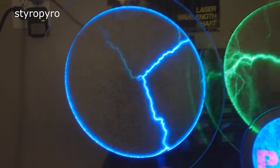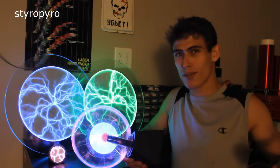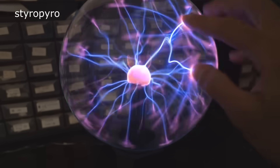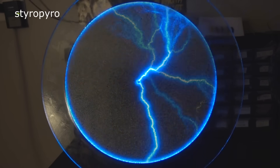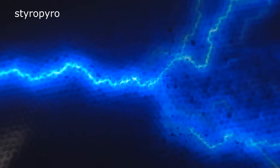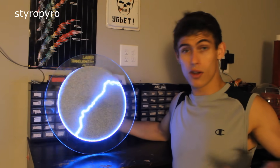I should at least give you guys a demo of the original product before I start tearing it down. Lumen Glass comes in a bunch of different sizes and colors — there's blue ones, green ones, miniature ones, and even some really cringy ones. So how do these things even work? Not surprisingly, it's very similar to a plasma globe. In a plasma globe, the inside is pumped down to vacuum and then backfilled with a tiny amount of noble gas mixture, then hit with a high-frequency AC which excites the gas and makes it glow. The 2D version is different in that the glow you see isn't directly coming from the gas itself. If you look closely, you can see the plate is filled with tiny beads dyed with fluorescent compounds. The arc doesn't actually go through these beads — instead it weaves around them and makes them glow from the small amount of UV light it produces. Touching the plate is pretty nifty because it draws a little arc of electricity to your finger, and you can adjust the audio sensitivity so it moves around when you talk or in unison to music.